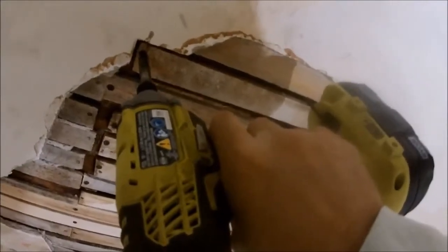If you have any existing old lath that's falling down — because a lot of these old laths have nails that come out — make sure you put a screw in those too, or else when you go and put your plaster back up it's going to be spongy again. See how the wood is a little bit spongy? You don't want that because if the wood is not on there secure and tight you're going to have movement in your plaster. Make sure when you push on it there's no movement in the wood, other than a little bend in the middle under pressure — that's normal.